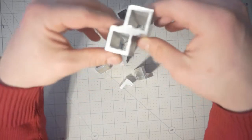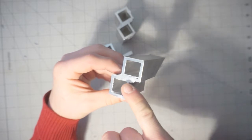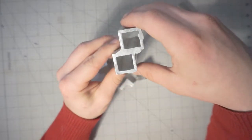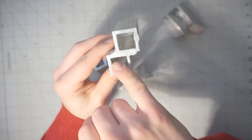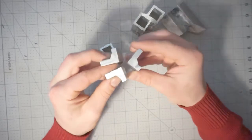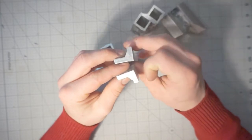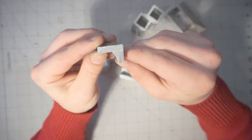I went ahead and cut these welds and acid etched them so you can see the different colors where the weld was — that's showing the penetration. You can also learn other things, like I got some porosity in there, probably because I didn't clean my base metal very well. I was pretty impressed with how it handled the quarter inch aluminum stock — you can see that one has some pretty good penetration and it's a nice looking weld, with a nice bead in there.